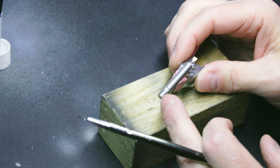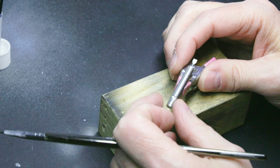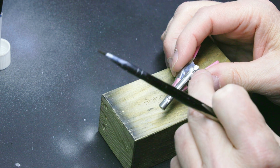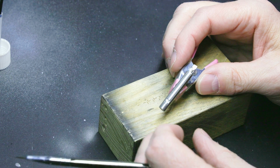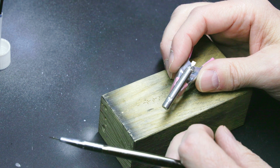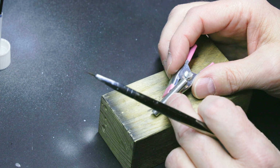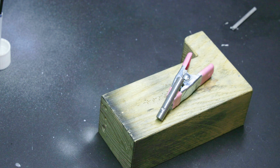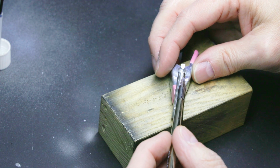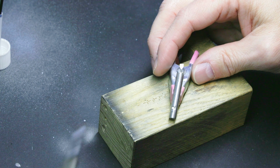So this is 2 pieces. This is a fork tube for a motorcycle. They cast the main piece with a groove out of it, probably to reduce the amount of material in the single casting, so it wouldn't warp or shrink too much. And then there's an insert in there. Now these parts I want to polish when they're done, so I essentially need this joint to disappear. So soldering is the best way to do that.